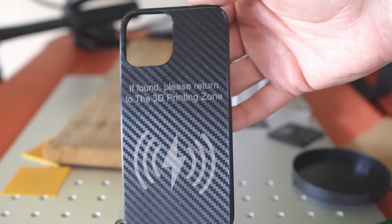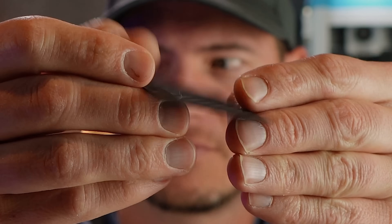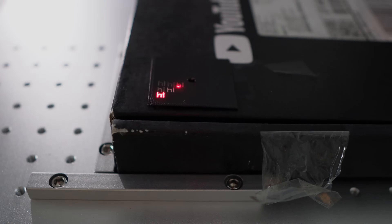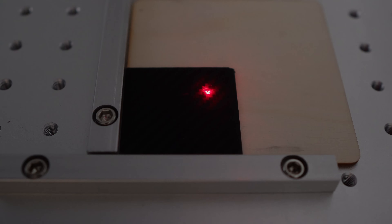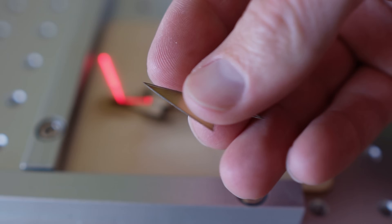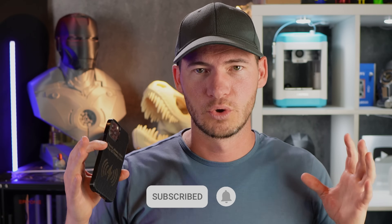This is so amazing — this fits well, it looks good. This is now my new phone case, and I can still put my wallet on the back of it. So if you're looking to do laser engraving, make sure you start small, adjust those powers and speeds — and something I didn't mention: also look at the frequency of the laser. And make sure it's focused. A lot of laser engravers have automatic focus, but having proper focus will make or break whether you can cut through metal or get that fine detail. Make sure you subscribe to watch more laser and 3D printing videos.